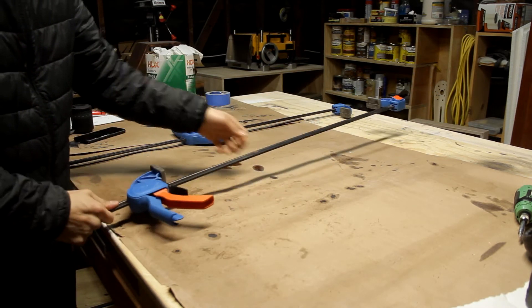This next one is going to come in super handy if you don't have a joiner and you want to glue up a panel. You can see these two boards here — I'll join these edges together. You can see they are terribly aligned right now. What we're going to use is a level that'll ride along our fence. This way we have a nice straight reference to use along our fence and we'll push the board through with the level. You want to make sure to move it together or else this is just an extension of your fence. These are pretty bad, I might have to do it a couple of times, but I'll go ahead and show you what it looks like. You can see if I try to glue these up into a panel, you can see how terrible this seam is — so I might have to run it through with the level a couple of times, maybe three times, but remember what this looks like. We're going to clean that up a lot.